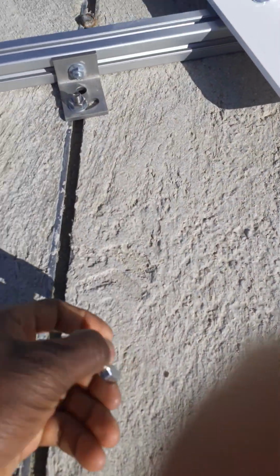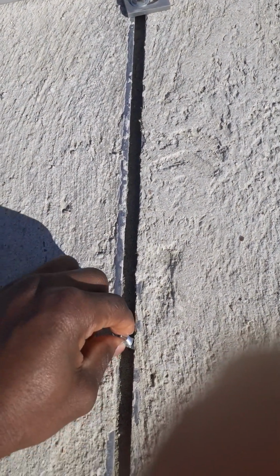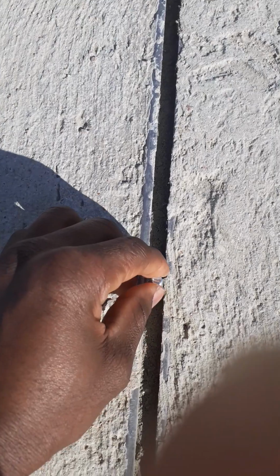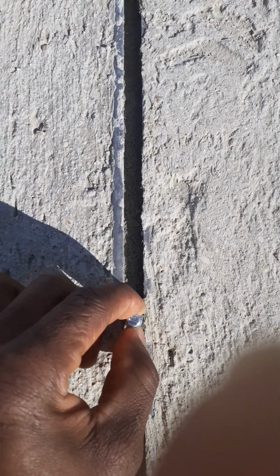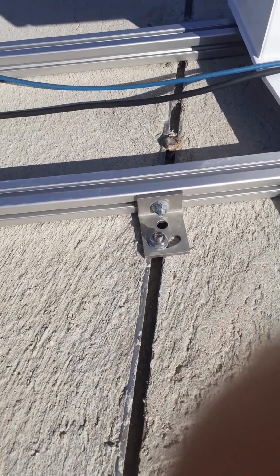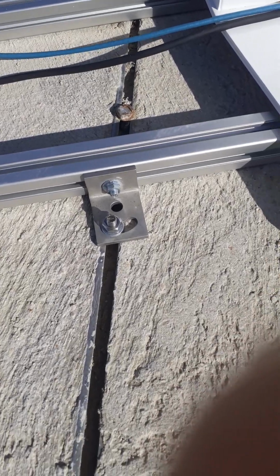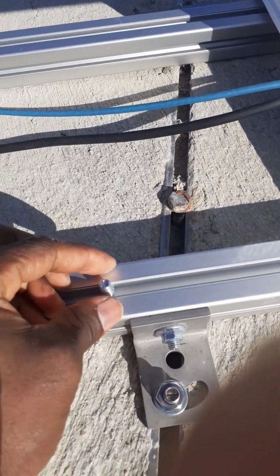It's just like this. Bolts with a broad base, and you slide into, and then you turn it, and then it locks. And the way they are designed is that the direction that it locks has a line in the middle, so it should tell you that you have correctly aligned it and it can lock, and then now you can apply your nut. So I fixed two of that, one on each side, and then hooked it up onto this aluminium bar, which is also designed to work on basically the same principle. This turns and it locks. Yeah, and you can just remove it.